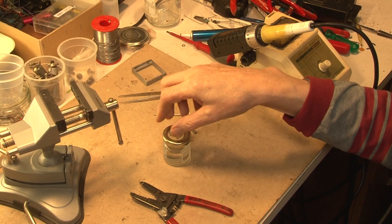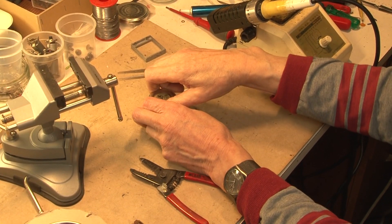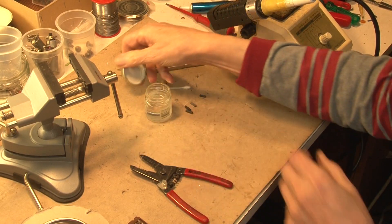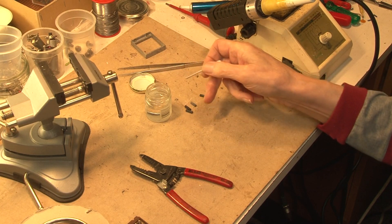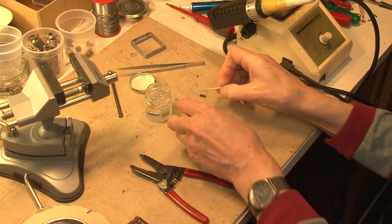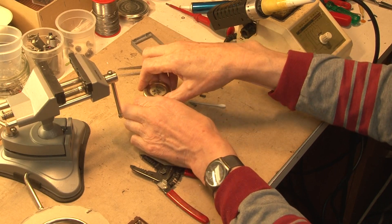This little jar is Hellermann oil used with the Hellermann sleeves. And here is a cut-down cotton bud which is quite useful for transferring a small quantity of the Hellermann oil to the inside of the wire sleeving. But we will see that in action at the appropriate point.